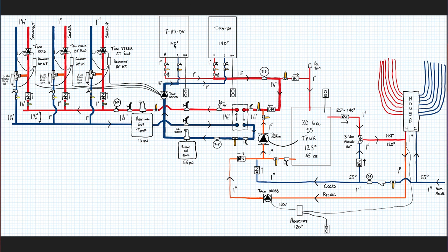In the last video I determined after doing all the math that I was right on the border for one tankless unit for the snowmelt. The output taking efficiency into consideration on one unit was around 183,000–185,000 BTUs, and my snowmelt requirement on a design day was 175,000 BTUs — that's with zero degrees outside, five-degree wind, and six-inch on-center tubing. I ultimately made the decision to go with two units for redundancy.